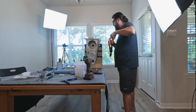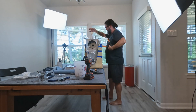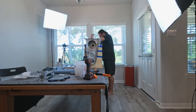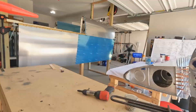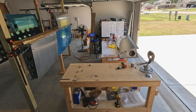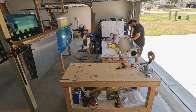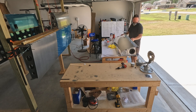Once these are all in place, the tank will go back out to the garage and we'll do the rest of the squeezed rivets. I'm really anxious about the pressure testing on this tank because I feel like it went together pretty well, but you never know. As a reminder, every place there is a Z-bracket will remain unriveted today — those will happen tomorrow on both tanks. We already did the interior ribs' upper and lower rivets, and on the end ribs there are four rivets each that sit outside of the Z-brackets — AN470 rivets — and that's what I'm installing now.